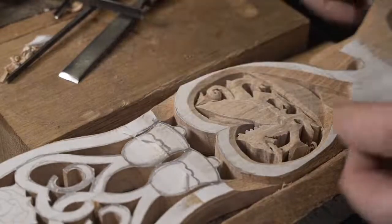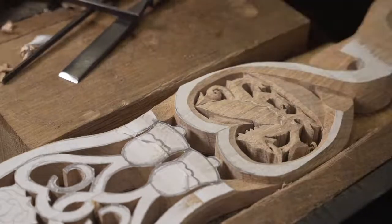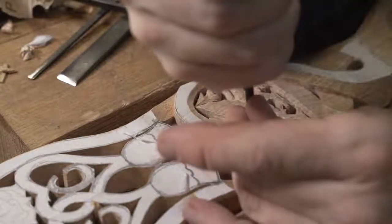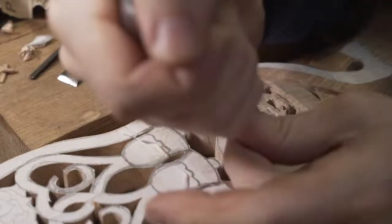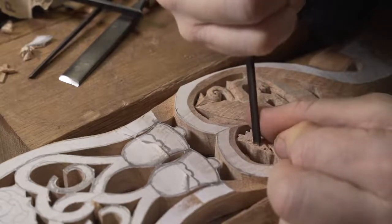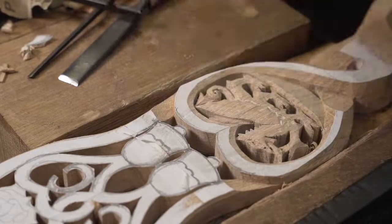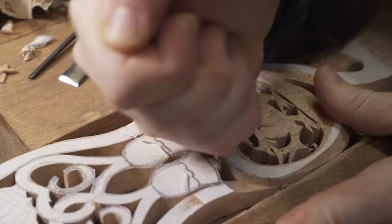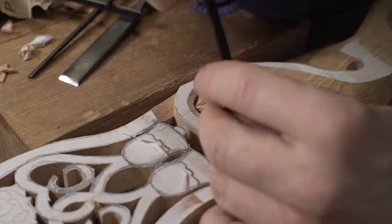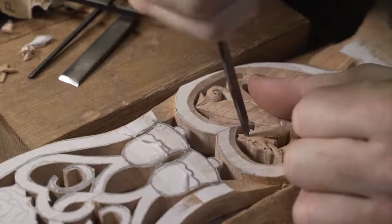So once we've rounded everything off and we've got the finish that we're looking for, not far off, I think it'll do for now, we start adding our detail. So the first thing I'll start with, we put a little full stop for the nose, and then we get the eye on there. To add that detail, we just curve the gouge one way, curve the gouge the other way, use that stop cut, cutting in like so, and then a bit more depth at the front of the eye. So get right in, clean out any little bits of wood that are left over. We have our fantastic little micro gouge, and that can be used to finish off the eye. We then use a straight gouge, there's a little bit of detail on the dragon just in by its ear. So we just put a little, almost like a little lightning strike, like so.